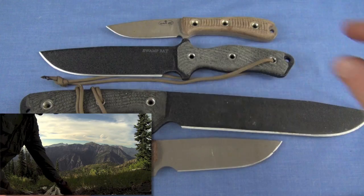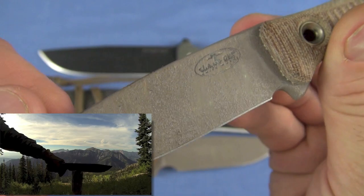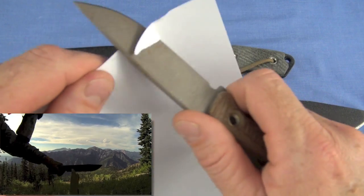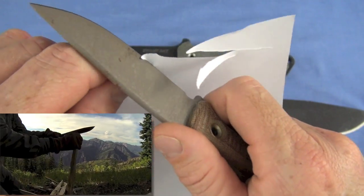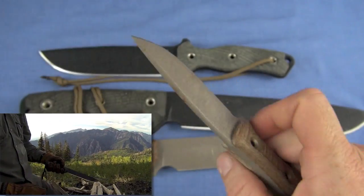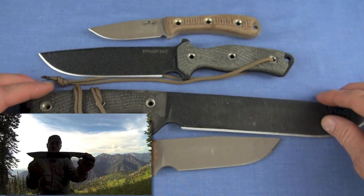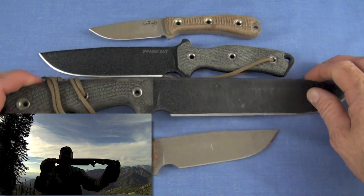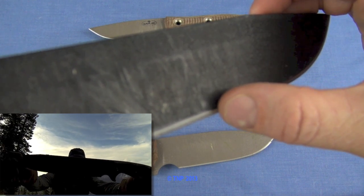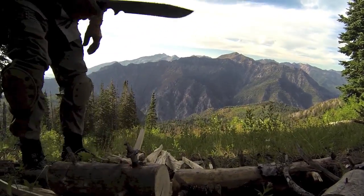Cool knives. By the way, I did forget to say this when we're talking about cool factor differences. This is actually a convex blade right here, the Rodent Solution. And I didn't check the edge on that one. Don't know who sharpened this one, and it has been worked over up there. Oh, now that's a better edge right there. See it? All right. Still needs some work. A little bit better than the Rodent 6, though. Convex on this one. And these, I forgot to mention, are what they call ultra-convex saber bevels. So it's not full flat ground. It's a saber grind, as you can see, starting from right about here. A 1 degree off flat ultra convex bevel. It's near FFG, and you can sharpen it conventionally, which I prefer.